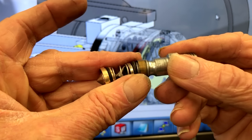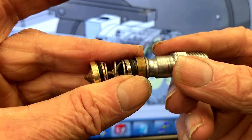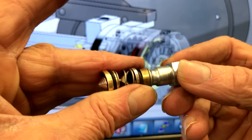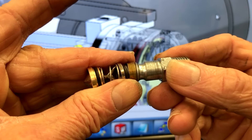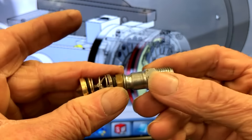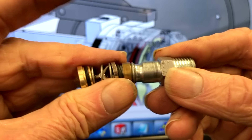This is just really, really not acceptable to me — a very, very poor design. Not to mention the fact that the poppet can shift off center, causing it to leak. Worse yet, it can pop completely out and get stuck in the open position, just blasting air out, so you have to resort to closing off the main supply valve. That's already happened to me three times. So let me say it again: this thing is a really, really poor design.